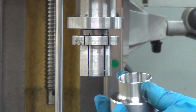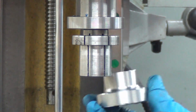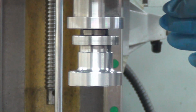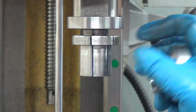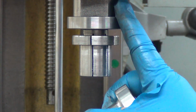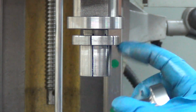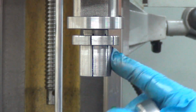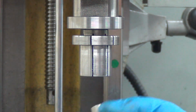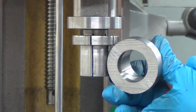they have a little groove in there. Well, it falls into that groove, and I couldn't get it to stay very concentric. So once I put it on here, it stays very concentric. And there's the 3/4 inch shank on this, and I've just got it right up into the TTS 3/4 inch collet. Now, if I'd had another one of these, I could have machined it and put a step in it to stop it. I need it to stop because I'm cutting the inside bore here.